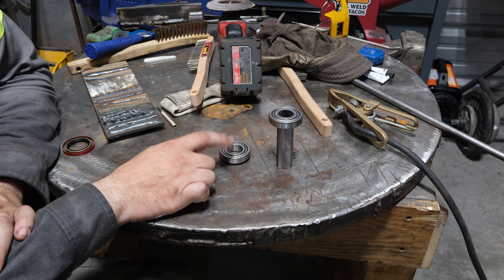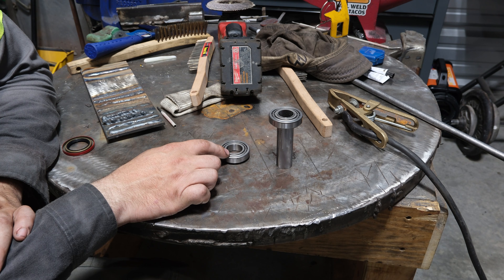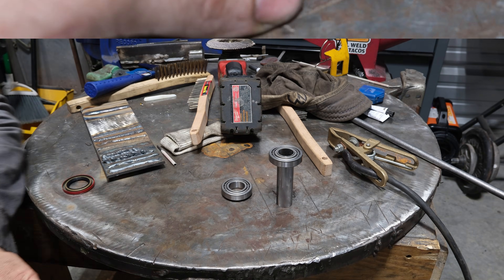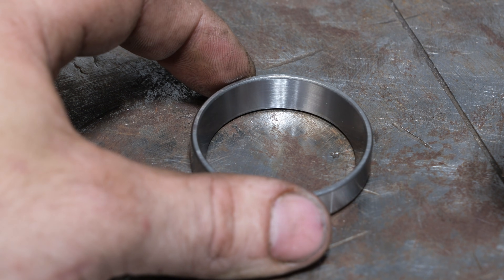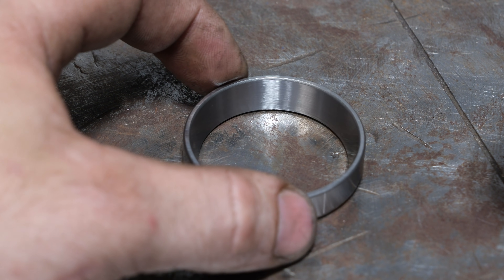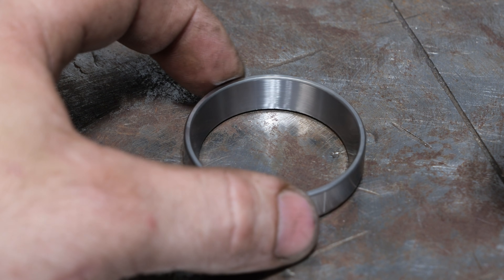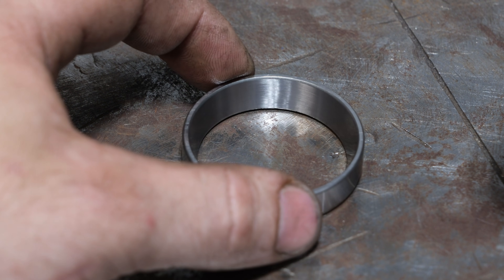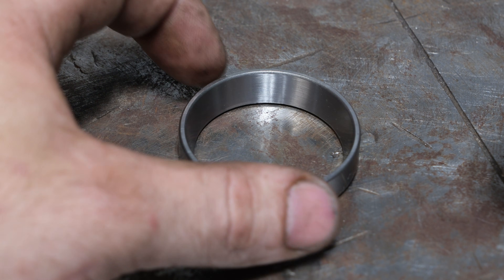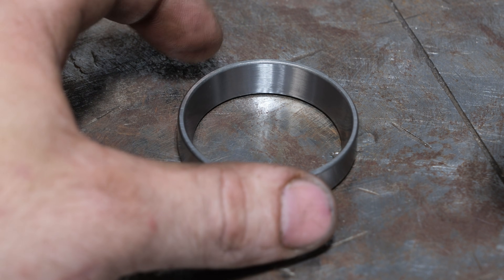This race needs to be heavily polished, very clean, and not have ridges in it — arc marks internally are absolutely not what you want. So let's take a close-up look to verify how clean this bearing is before we test it. It's pretty difficult to get a high-resolution image of this bearing race because of how polished it is, but I'm going to spin it — look at how clean that surface is.